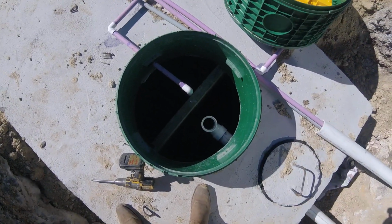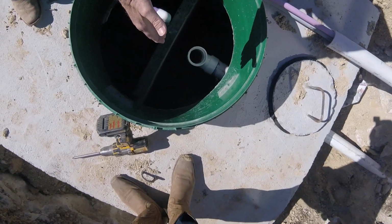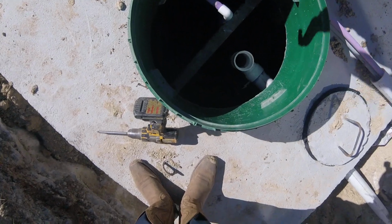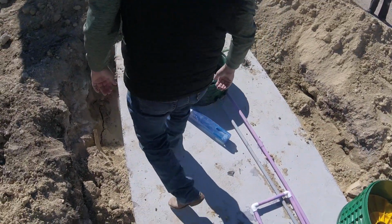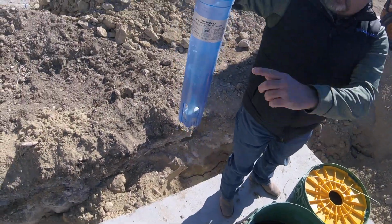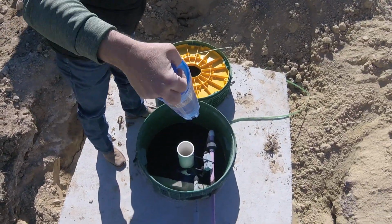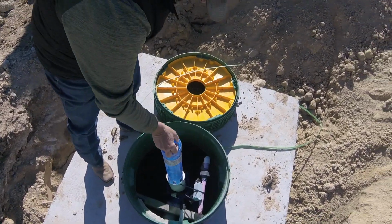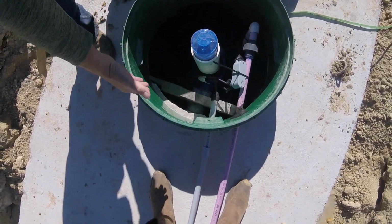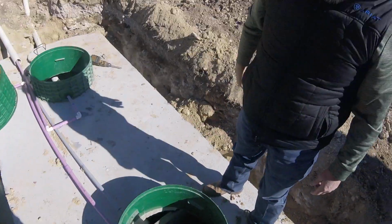And then these are the different compartments. We've got a trash tank. This is the actual aerobic unit. This goes down. You see the air pumping as we're sitting here. You walk over to here. They've got their chlorinator out. It again is NSF tested. They've got chlorine in there. This is the pump tank, and there's a clarifier on that side. So the pump tank's 500 gallon per day.